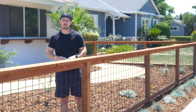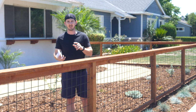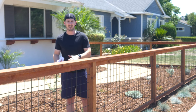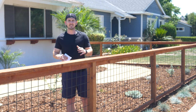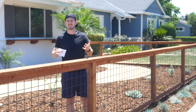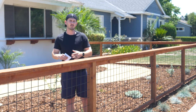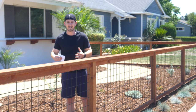Next I want to talk about tools. Everybody is going to have a different set of tools. I designed my workflow around a well-powered table saw and a dado stack, a miter saw, and what I consider the hero of the project - an auger. This was a six inch auger that could drill all the way down to 30 inches; I only ended up drilling down to about 20 for each of the posts. I'm honestly not sure I could have completed this project without it. I tried manually digging some holes off camera and I don't know if it would have been physically possible. If you don't have one, I'd highly recommend renting one at Home Depot or Lowe's - they're quite affordable for just half a day.